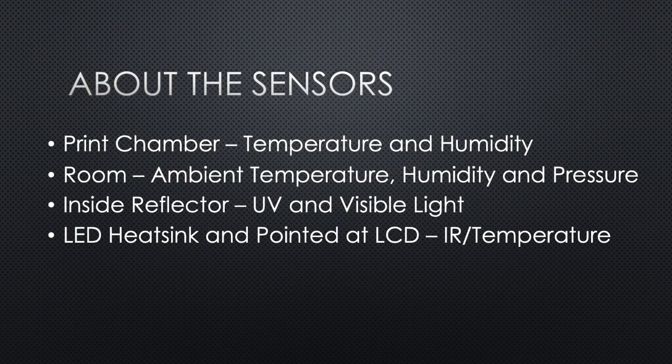It's important because we've started to note that much over 40 degrees Celsius, I want to say it's about 45 degrees, we start to see failures and issues with the screens. So being able to watch your screen temperature can tell you a lot about the cooling in the environment. One of the other nice things about that sensor is that it can measure the temperature around it as well. If we use that, then we'll be able to measure the temperature of the heatsink, which will give us a pretty good idea of the temperature of the LEDs.